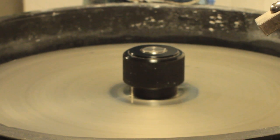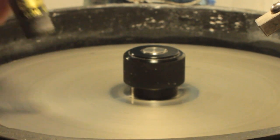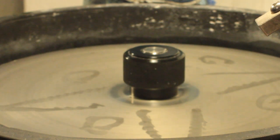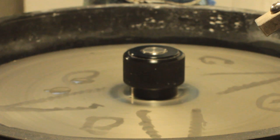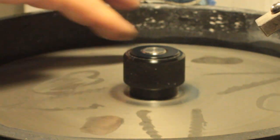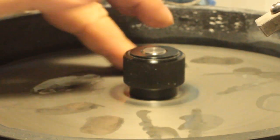Okay, to get a new lap ready to go with new 3000 grit diamond, I take our diamond stick from Gearloose, 3000 grit, and put it on the lap, some kind of design. Then I take the Professor Ignatius snake oil and I use one drop. And of course two drops came out. That won't hurt anything. You can always add more later or wipe some off. Then just take the oil, which will melt the 3000 grit diamond, and then just rub it into the lap.